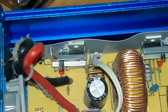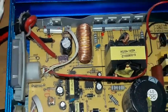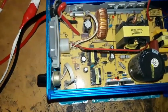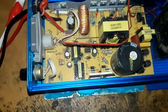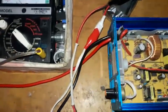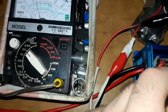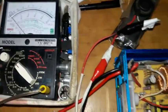This is where the negative is connected and I've already connected the AC. First I'm going to test if there is a voltage. I set my VOM to the 50 volt scale and turn on the switch. Nothing blew up — that's a good sign. The LED is lighting up and we are getting roughly 13.2 volts.